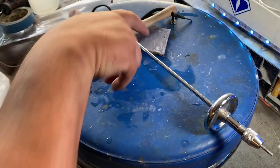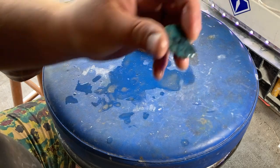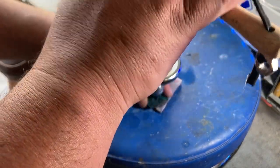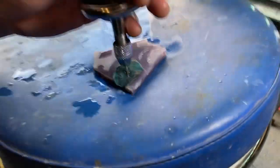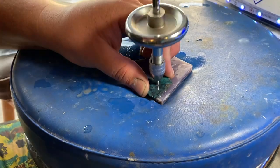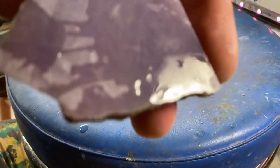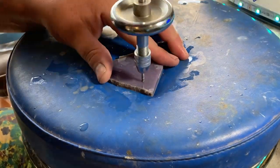So what I did was, just as an example, I took a piece I already drilled, laid it on top of the workpiece. Let me try to get this angle for you folks a little bit better so you can see what's going on. And I used the hole as like a guide to create a divot. After I had my divot, I no longer need that, and it's gonna stay in place. And now it's just patience